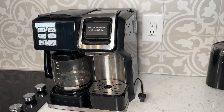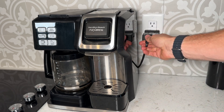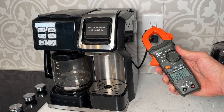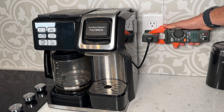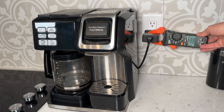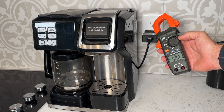In the past I'd use a splitter that splits out the hot and neutral side. You plug your appliance into the splitter and then use a standard current clamp. This splitter specifically multiplies your current by 10, so you go up to the 200 to 400 amp setting, clamp that around the hot side, and measure the amperage while running the appliance. But we're not accumulating anything — I'd have to monitor the fluctuations myself and make an estimate. That's definitely not the best option, especially for a multi-hour or multi-day test.